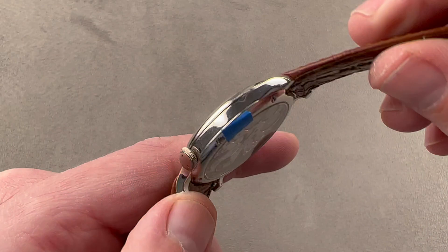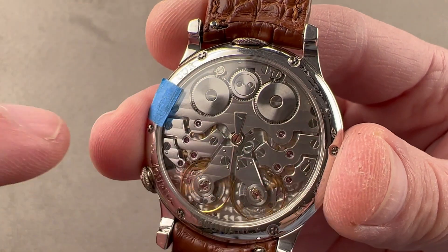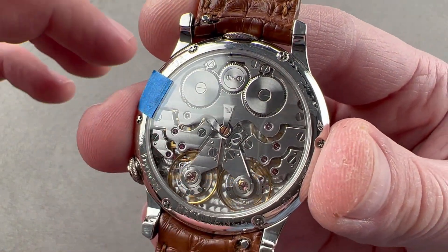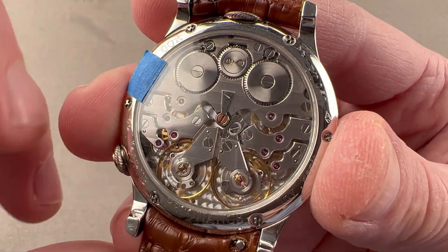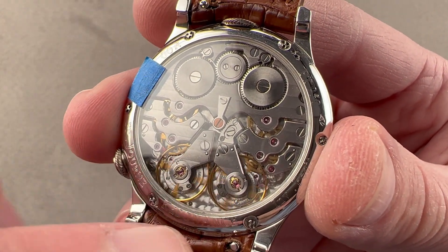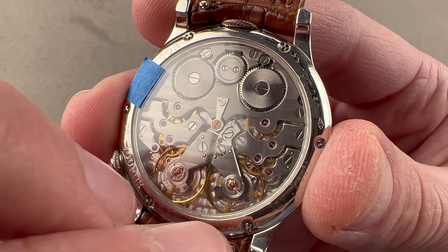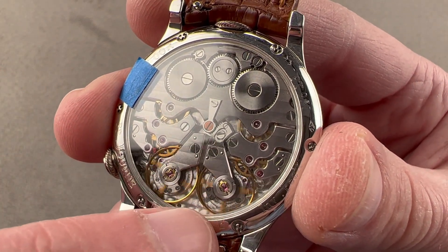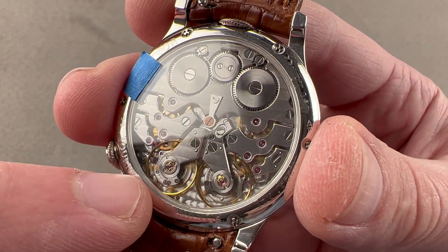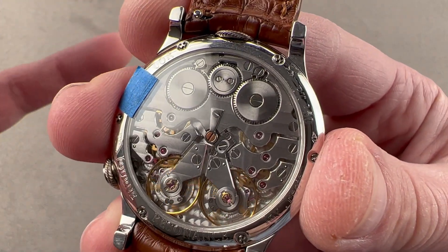There are two separate movements in this watch. As you can see, we have one crown wheel, but then two ratchet wheels with two clicks on top of two barrels, with two drive trains, two escapements, and two free-standing free-sprung balances. They are coupled together by resonance and nothing but resonance — no mechanical link between them. The parasitic emanations of energy from frictional losses result in the two synchronizing to each other. They beat in opposition but identically, coupled together so they vary by no more than five seconds per 24 hours. If for whatever reason — vibration, position, disruption of any kind — one of them slows, the other will speed it back up by an equal and opposite magnitude. Hence it is a self-regulating chronometer: Chronomètre Resonance.